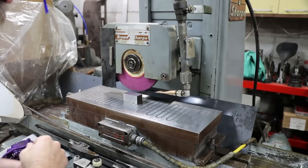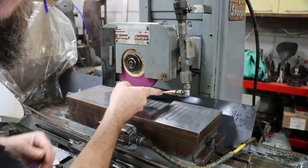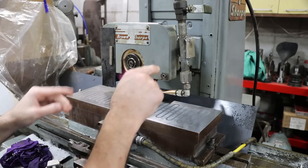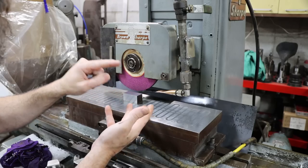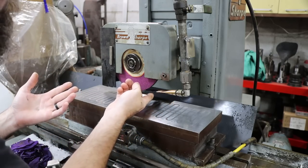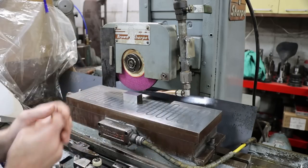So that is a pretty neat little coolant spray nozzle. Now, there's a bunch of different ways that you could accomplish the exact same thing. I built this one this way because I thought this is probably the way most people would do it. You could machine this out of a solid block, and we could go through the trouble of reaming the holes where the straws had an interference fit and super gluing them in. But I figured the majority of people would do something similar to this. All it took was a hammer, some copper tube, some solder, a torch. You could have even just got away with a hacksaw. It would have taken no machine tools at all to make this. You could do that with a hairdryer, heat those up enough to get them on there. You get the idea. We could have made it far more beautiful or intricate or advanced, but this will serve the purpose and probably do just as good a job as anything else a person's going to build.